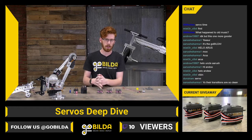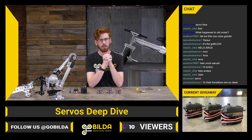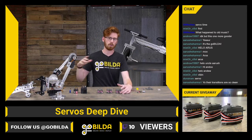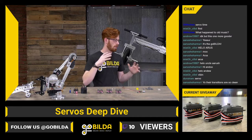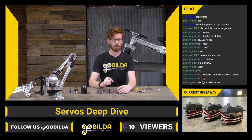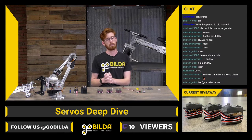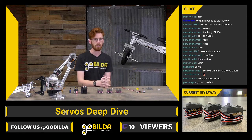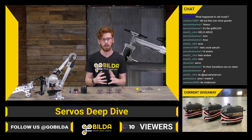As far as goBILDA servos go, we have 3 different ratios of our 2000 series servos, the torque, speed, and super speed servos, and they're really designed for 3 primarily different applications. Where you've got something that needs to be really fast, somewhere around 275 RPM, you reach for a super speed. A speed is that really nice middle ground where you might want to run a linkage or run something that is lever arm based. And the last option is the torque servo, where you just need the amount of torque to lift up something or move something that requires a lot more force, but doesn't have to happen in any necessarily fast amount of time.